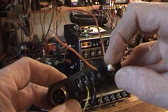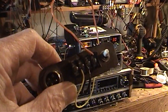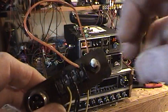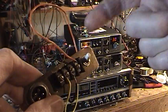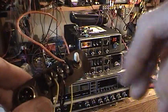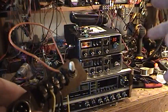A lot of these CBs won't receive anything unless you have the mic hooked up, which is kind of odd. It makes the receive circuitry switch off and the transmit circuitry switch on. By jumpering the wires in, I can at least get it to receive and transmit. Some of the older CBs use a relay and will receive as soon as you turn them on, but most ones after around 1976 you had to actually hook up the microphone.